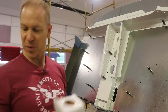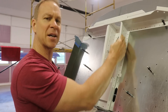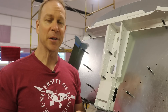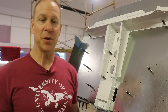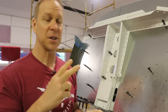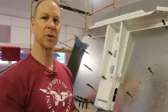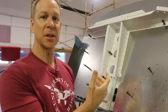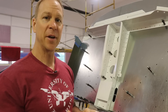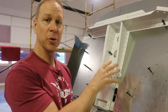There are eight bolts per side that hold this in there. When I put this in originally, I was just using the regular nylon nuts, and it always kind of bothered me because I realized later that you're not supposed to use nylon nuts ahead of the firewall. It seems controversial — some people will tell you you can, some people will tell you you can't. These are home-built airplanes, so you can legally do whatever you want. On my second home-built, my RANS, I had nylon nuts ahead of the firewall and the inspector wanted me to change them before they would sign it off.